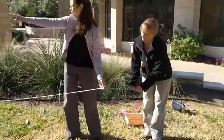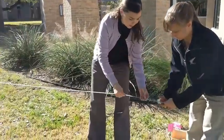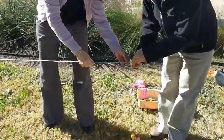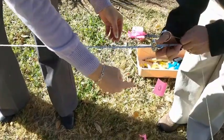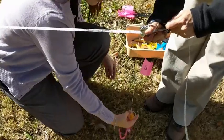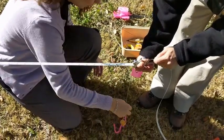So basically you center it around 0, and once you do that, find the nearest foot. In this case, it's 25, okay? And you're gonna put the plumb bob string on top of that little line, and try to align this so that the plumb bob is exactly above the nail without touching it. Because if it's touching it, it might be leaning and you might not be right there.